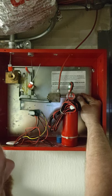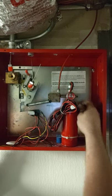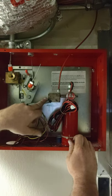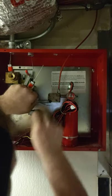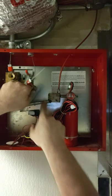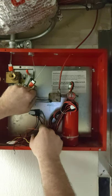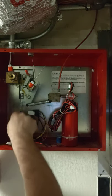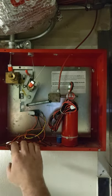I'm going to push this a little bit more — a little bit more — and there we go. This piece right here, it went back in. Because it went back in, it let this lever that was holding it come back, pop that, and then put that piece down, which would have gone into the cartridge and pressurized all the way to the tank and dumped the tank.